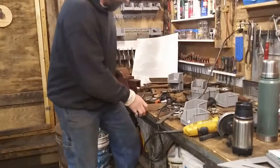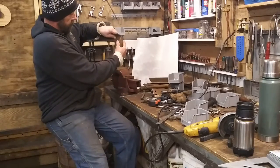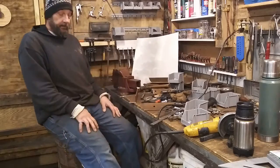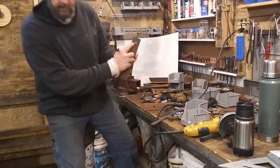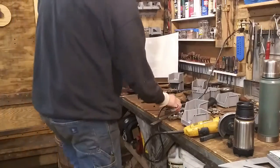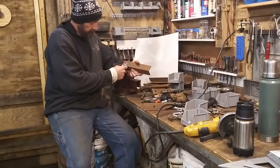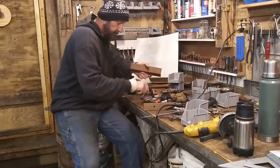All right. Pilot hole's drilled into piece now. Excellent. Now, I guess I'll show you guys how I set this up so you guys can know. And like I said, if you can see the lines, that's from me taking my 1 inch on the combination square, and I run from the angle side. I run in 1 inch, and then I run in 1 inch. Center punch.